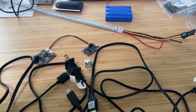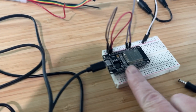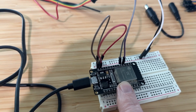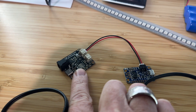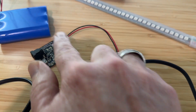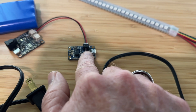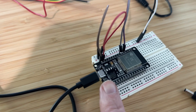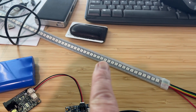It's been a week for me but five seconds for you, and I've definitely gone the route of over-engineering this. What I'm going to try to do here is kind of crazy, but I hope it works out. This is an ESP32 dev chip — a little microcontroller. I've got these little gizmos: one takes power in from a solar panel and charges the battery, then the power goes out to an adapter that steps it up to five volts, which is USB voltage, and then that goes into the microcontroller. The microcontroller is then connected to this LED strip.